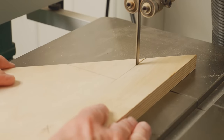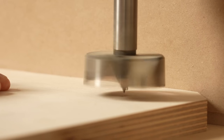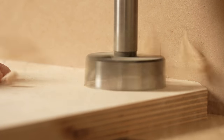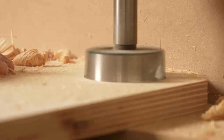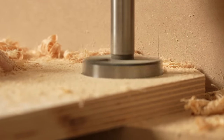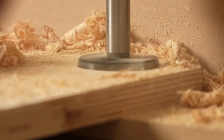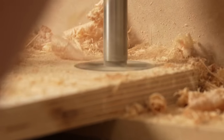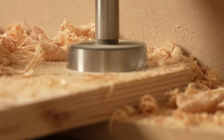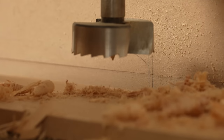The cuts are made with a jigsaw or a bandsaw, and for the hole, use a 2-inch Forstner bit. Using a 2-inch Forstner bit creates an awful lot of torque, so make sure that you have a good fence stabilized and clamped behind. As you're drilling, make multiple slightly deeper passes to keep from overworking the bit and burning your work. A sacrificial board laid underneath will prevent tear-out as that bit exits the backside of the jig.